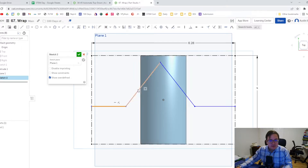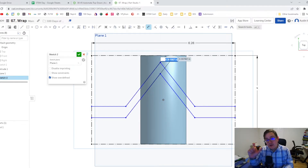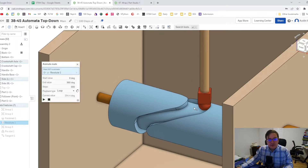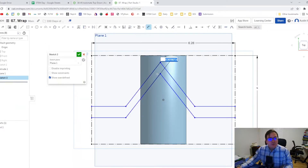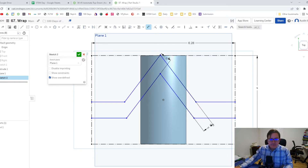There are a couple of ways you can augment this. I'm going to highlight the top of my profile, copy and paste, and throw it in right next to or underneath. As far as the distance in between, this is going to be a window of tolerance for our dowel rod. The end of my automata foot has a certain dimension to it — I think it was three eighths of an inch. So the path of my barrel cam needs to be at least three eighths of an inch thick, but let's give it a little extra wiggle room — let's do a half inch.